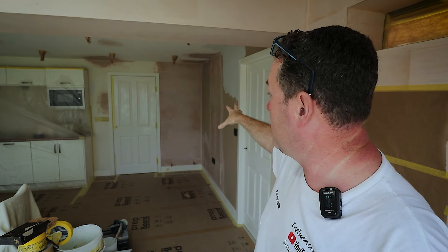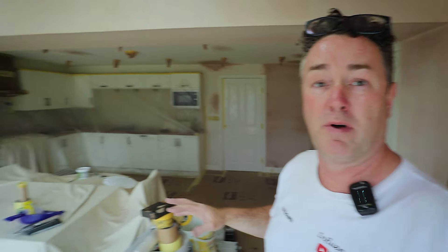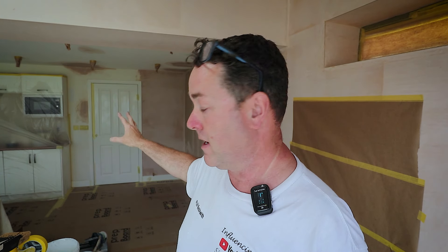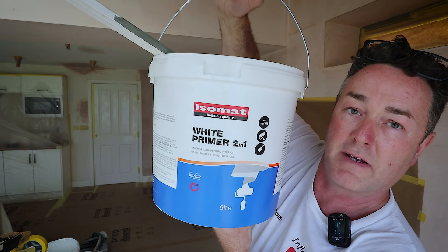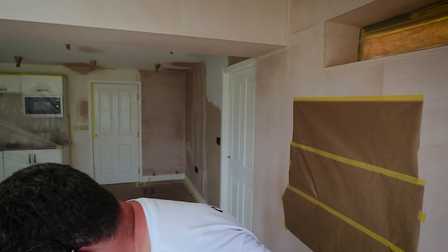I'll tell you what I'm going to spray with. This is bare plaster and I've got some areas that have got cheap contract matt emulsion on before, and then the builders have skimmed out some areas. My preparation for this room — once I've got everything bagged up, I've even bagged up the new trifold doors with the drop sheet, about eight foot drop, and taped it up. I'm going to be spraying with the Isomax — it's the white primer two-in-one. I did a previous video on that where I brushed it thinned at 10% and found it a little bit hard to put on.